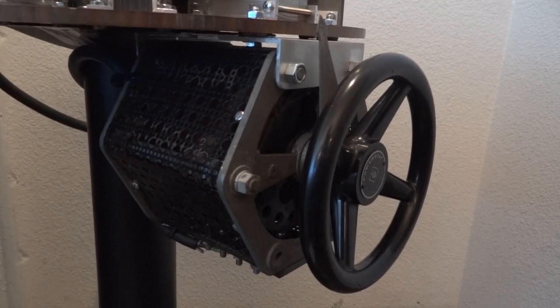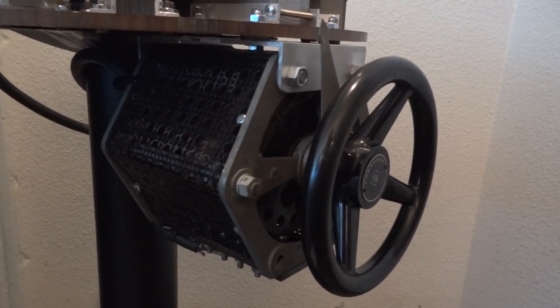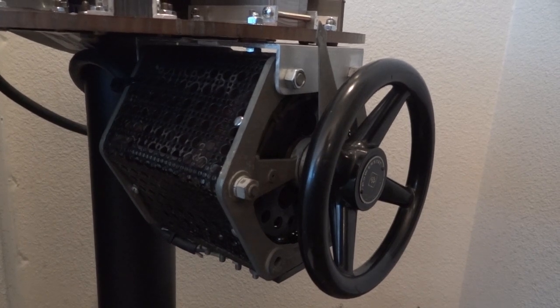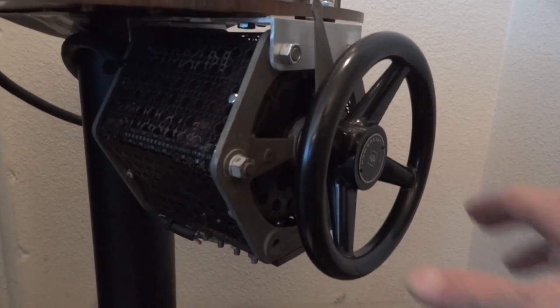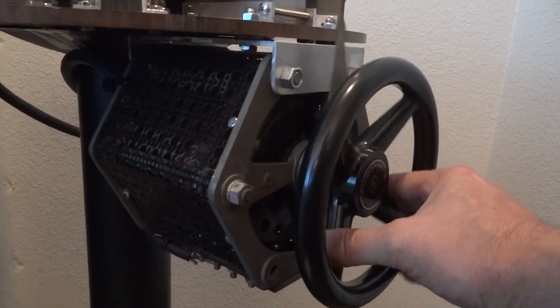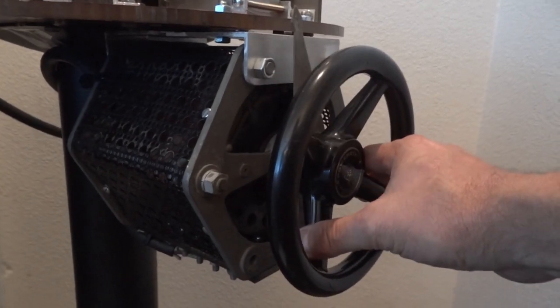For controlling the AC drive current, I decided to go with an old-school Variac because they're quite bulletproof, and I had this one sitting around just waiting to go into a project. It's essentially a 240-volt transformer bent into a circle with a knob that adjusts the turns ratio by moving a carbon slider along the windings.